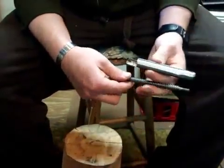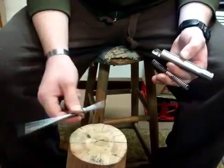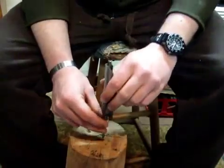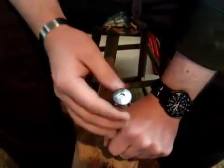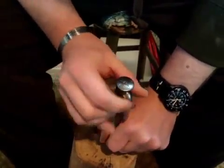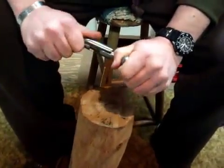Don't let go of this or it'll pop back — just let the pressure off slowly. You'll see your spring in there and the ginormous firing pin this thing has. Like I said, the design of this bolt is incredibly complicated considering the Russians produced millions of these rifles. Going back together is the exact opposite. Compress the spring — you'll notice that on the back of every Mosin-Nagant bolt there's a slot cut, and that slot is there for a reason. They get it set the way it needs to be for proper firing pin protrusion, then they mark the bolt with that slot to show the proper way to put it back together.